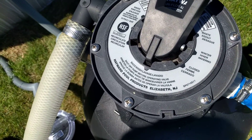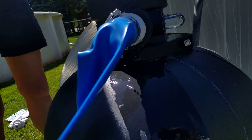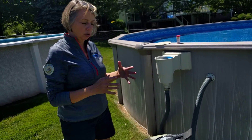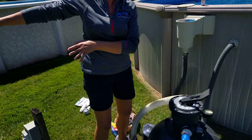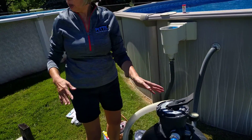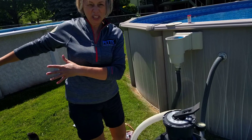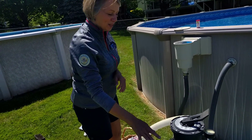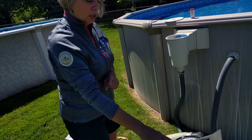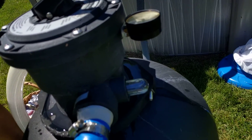Backwash is cleaning the sand — you'll see it's actually dripping out a little bit here through the backwash, so you know we've activated this port. When you backwash, what you're doing is making a big explosion of sand on the inside — turning everything up, getting everything loose and cleaning it all out. Then we're going to spit water out through our backwash hose or discharge hose. These come in different lengths: 25, 50, 100, 200 foot — whatever length you need to get it safely away from around your pool. Backwashing is cleaning the sand; I do suggest you clean the sand once a week. Backwash is no more than one to three minutes. Check your sight glass — as you're backwashing, here I'll turn it on for us really quick. Careful you don't get splashed.